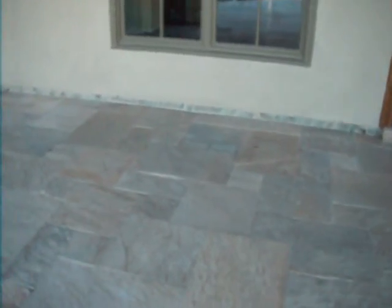There's no foundation exposed around here, but we do have that gap, that 4-inch gap which I said I require on EIFS, and you'll want that on the right hand elevation. Here we are at the rear elevation. We can see the grade wall, which is good.